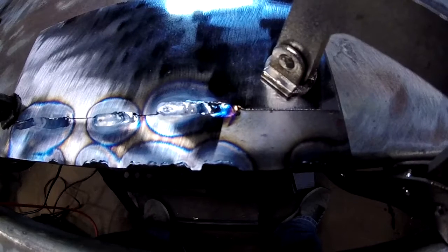All right, here is the fusion weld on that 22 gauge material. I have the machine set for 45 amps, pulse peak at 65-70%, pulse base 50%, on time 50%, and five pulses per second. It works out really well, and the pulsing allows you not to burn through that super thin metal.